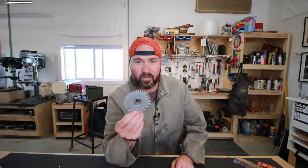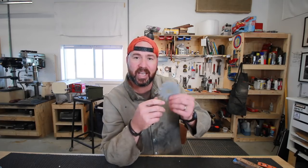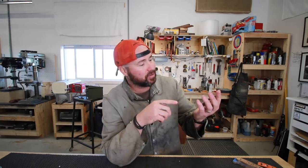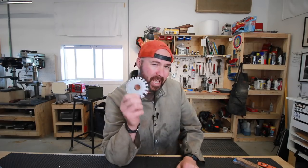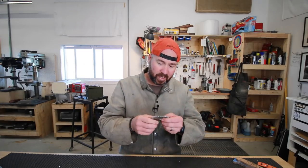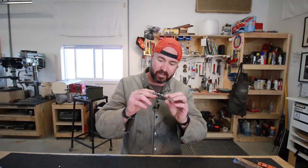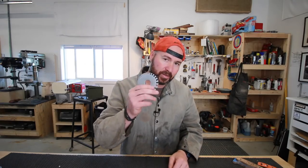A lot of you probably recognize this already — it's not that rare of a tool. This is a thickness gauge measurement for sheet metal. This one here in particular is the General number 21. Starrett makes a version. This one here is 28 bucks. I was actually surprised how expensive it was, but these are fairly accurate — the slots are actually ground in, not stamped. You can see the grind lines. So I guess it costs a little bit to manufacture, but it's a super handy little tool.